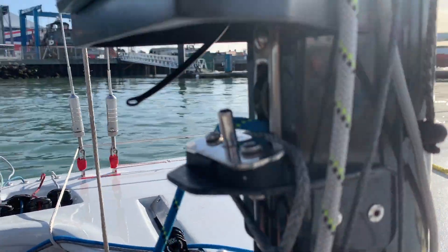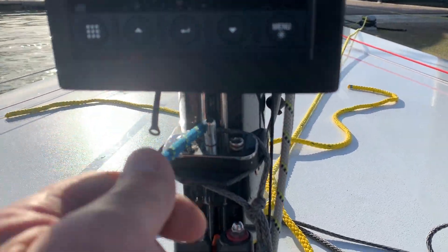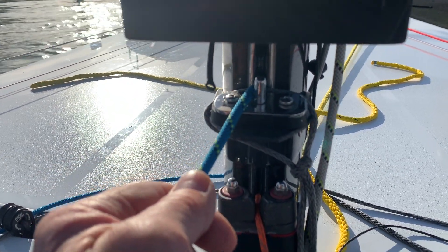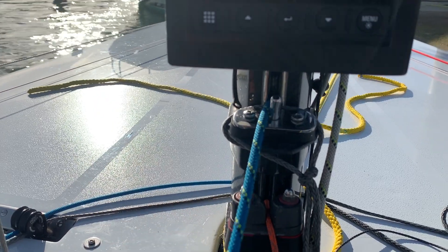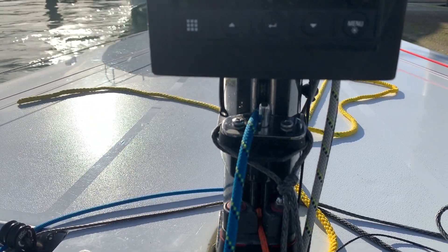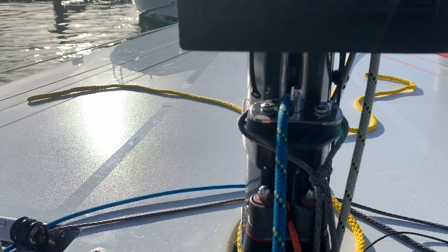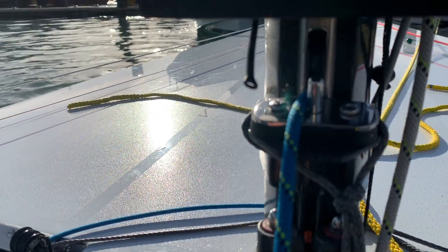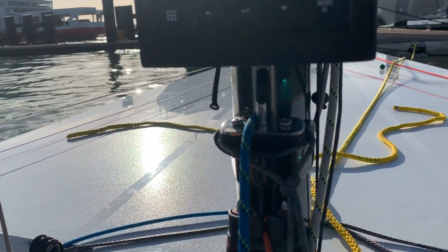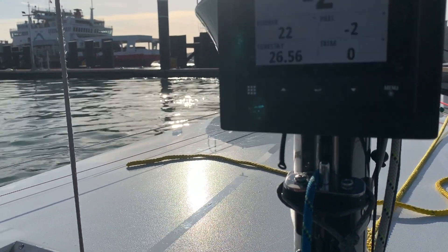So I've replaced the cleat with this custom-made — I call it a lock — but it's basically just a bit of stainless rod poking up there. This is the jib halyard, and when we get the jib fully hoisted, there are two eye splices onto each other. We put the second of those splices — the high-strength part of the jib halyard — onto that lock, and we're absolutely guaranteed the head of the jib has gone to the same place every time.